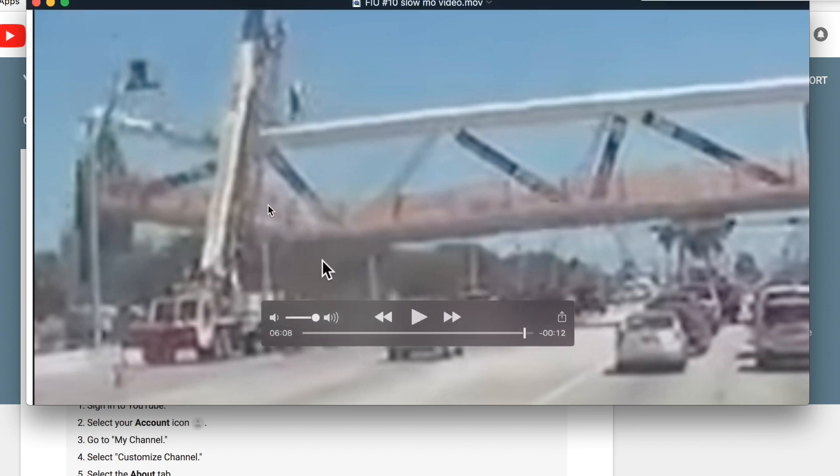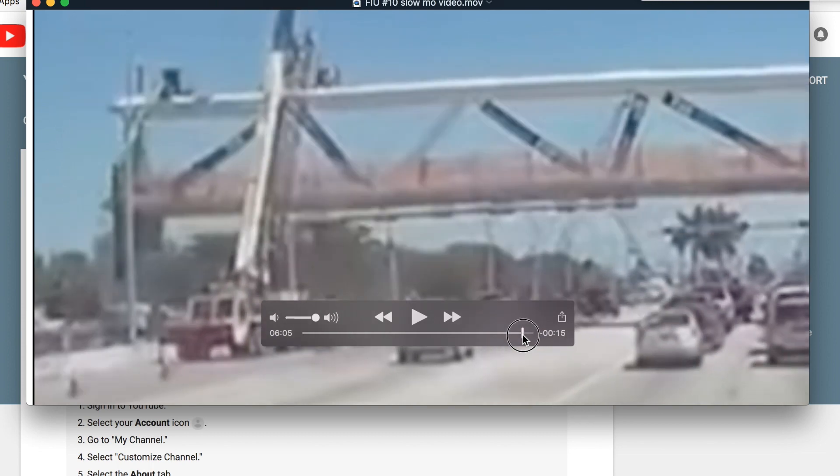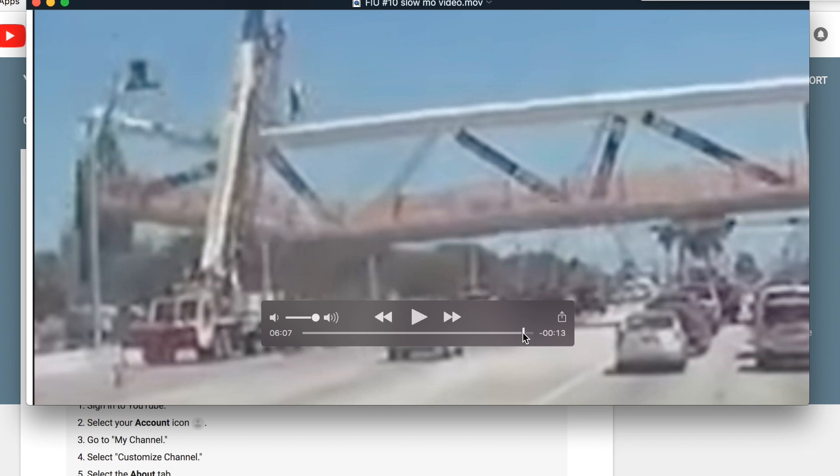So this is falling already — that would give you a slight deformation. It's already acting like a hinge here. It's hard to figure out which one's breaking first — the deck or the canopy. I'd lean towards the canopy. The canopy breaks, the voids in the canopy break first. This puts all the loads down on member 10. Now the shock load hits 10, it tries to make it out to the end of the deck with all the longitudinal post-tensioning, but it can't resolve it. It fails right where it comes down into contact with a little bit of cantilever. Member 10's zone of influence is right there.